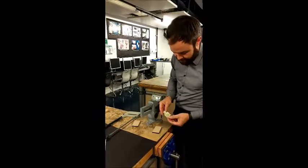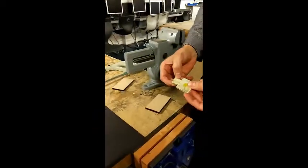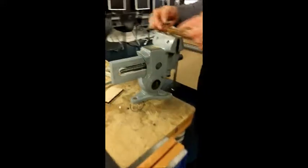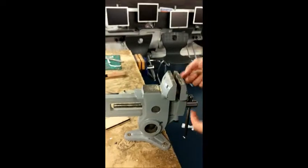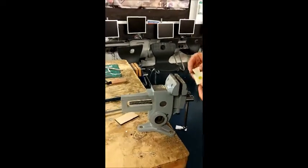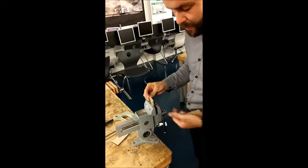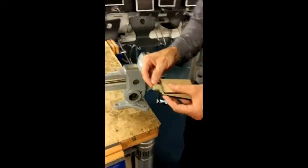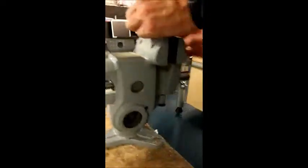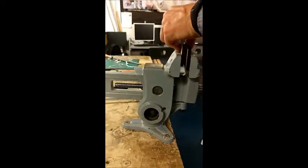We've just removed the casting from the mould and we've got to remove this sprue or flash at the top. Now I could just put it straight into the vise, but you can see the vise is made of a very hard steel, and pewter is quite a soft material, so there's a risk I could scratch it. So I'm going to use a slightly softer material — the MDF here — to line it up so when I put it into the vise it won't damage my pewter casting.